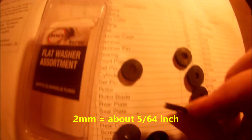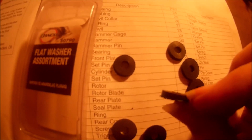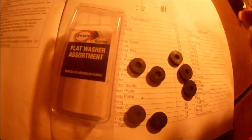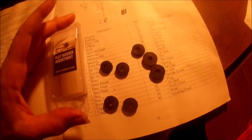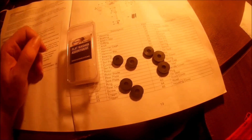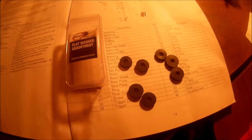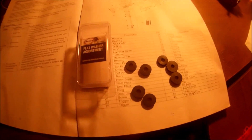The washers are about two millimeters thick. The original worn washer I measured was one millimeter, so it had reduced by about half over 10 to 20 years. You can fix this — these are cheap; I think the whole pack cost me about three bucks. They're nice to have around anyway to fix faucets if you have the old style with washers. Everything's working fine; hope this helps. Any questions, just ask — if I know I'll tell you, if I don't I'll try to find it, and if I don't know I'll tell you that. Thanks for watching.